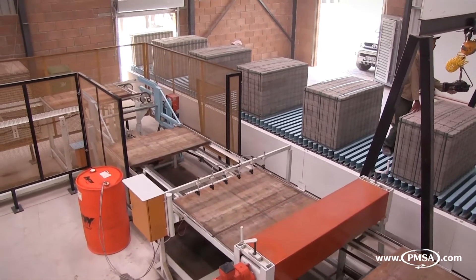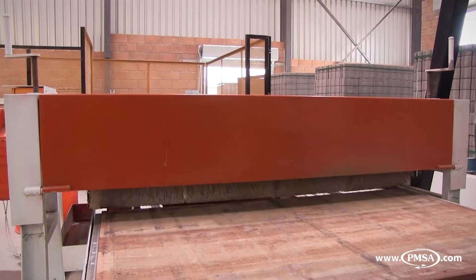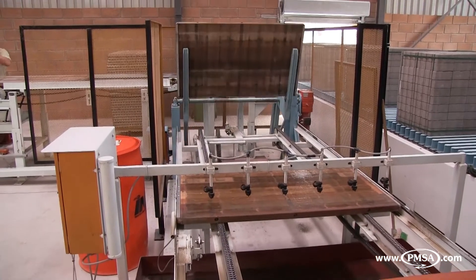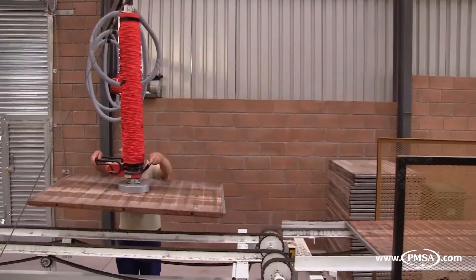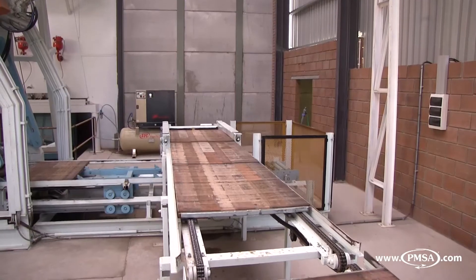After the pack head, the empty production board or pallet is moved along by chain conveyors, cleaned with a rotary brush, sprayed to keep the moisture content on the board stable, and turned over to get even use on both sides. The production boards can then be stacked by a swinger arm with a vacuum pad or sent straight back to the RE1400 machine for immediate reuse.